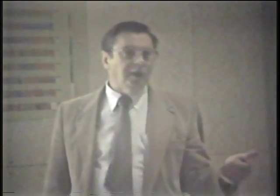Now, the people that are concerned about compatibility between machines say that even if you do play back a SuperBeta tape on an ordinary machine, chances are it's not going to be objectionable. You'll see a little bit maybe of horizontal streaking, but not very much of it. And I was told in Toronto that that's very true. Most people won't notice it until they get a lot of head wear on their non-SuperBeta machine. And with more head wear, that phenomenon will show up more and more.